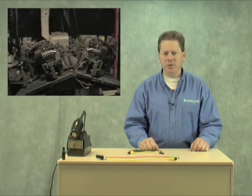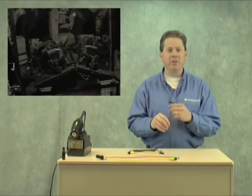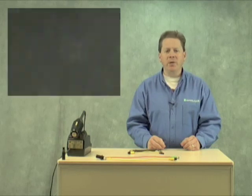Now we're going to take a look at metal face sensors and welding environments. In a weld environment you have two main concerns from the sensor's point of view. The first is the presence of weld slag — those hot molten fragments that whenever a resistive welder probes touch, that explosion happens and puts those fragments into the air, which can become embedded on a sensor housing or on the sensor face. Secondly, we'll look at weld fields, because to generate those explosions you need a lot of current, and that high current will create a magnetic field that can sometimes false trip a sensor if the field is strong enough.